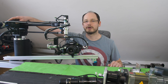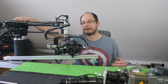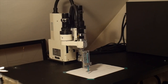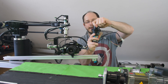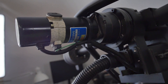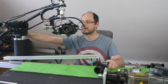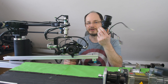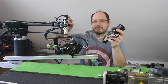I have six axes, so I'll explain all of them. This next axis is a DC drive that comes from another robot — a Hirata SCARA, an older one — with DC drives and harmonic drive. It's really similar in structure but smaller. It has a gear ratio of 1 to 80 and a DC servo motor attached to the harmonic drive. Even without a counterweight it can easily lift a camera with all the gear on it — really nice torque. And what I really like about DC drives is that they're very silent, which is great for quiet applications.